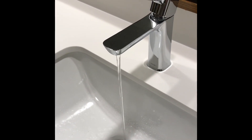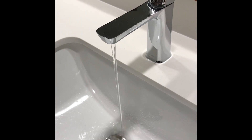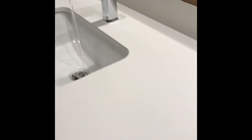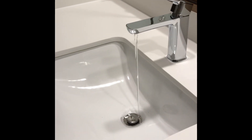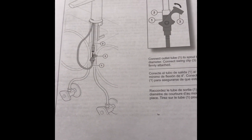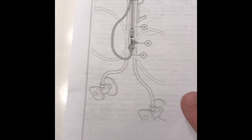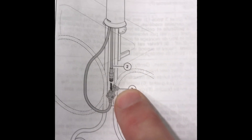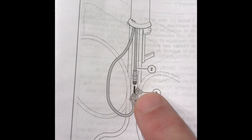I've got new Delta faucets installed with very low water pressure. My contractor installed them, but it was really my fault knowing we had ordered faucets that had a 0.5 gallon per minute flow restrictor. So down underneath in the lines there is a flow restrictor installed.